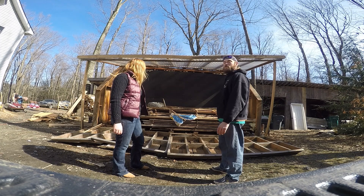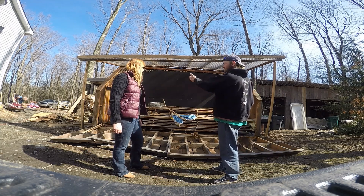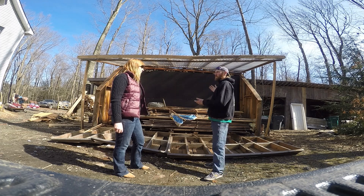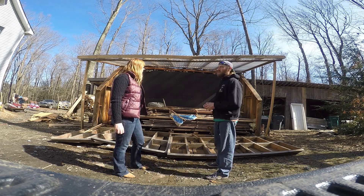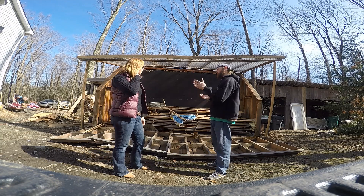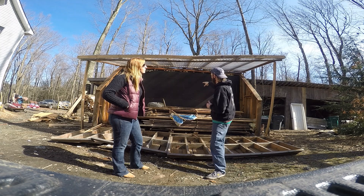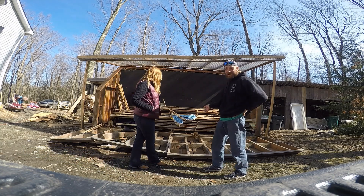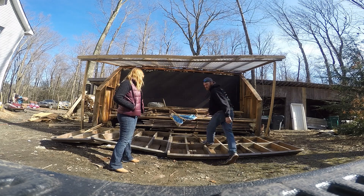The construction is just impressive — for a wooden trailer. It flops around and moves — I wouldn't haul it down the road, but around the property. Is it normally made with the black painted interior? You need the black to get the solar gain off of it — the black makes it like a car in a parking lot. A white car is not that hot, but a black one, forget it. It'll get 140 degrees in here in the summer — you need those fans going all the time. Would a tin roof work? You need the sun to be able to go through it and heat the inside. The heat from the sun is passing right through those plastic panels and heating up against the back wall, and then it's trapped like an envelope between the plastic panels and the back wall. The big thing is the air circulation — you end up blowing the humidity through every one of these boards and right out the front.